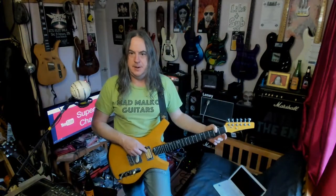Mental. Hey, Kenneth. The last two HS humbucker single setups I messed with ended up just having the single coil on the tone control, trying to get a closer brightness balance. Oh, right. You mean you intentionally put the tone control onto the single coil but not the humbucker, so that when you've got both of them on, you can dial the tone down. Yeah, totally.